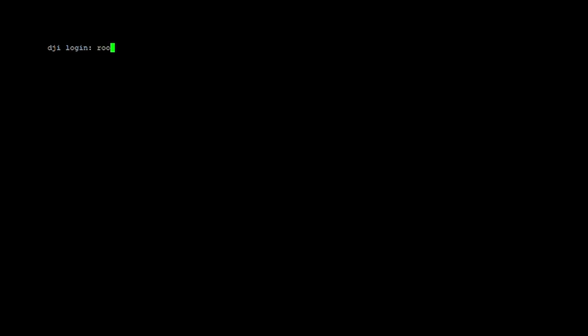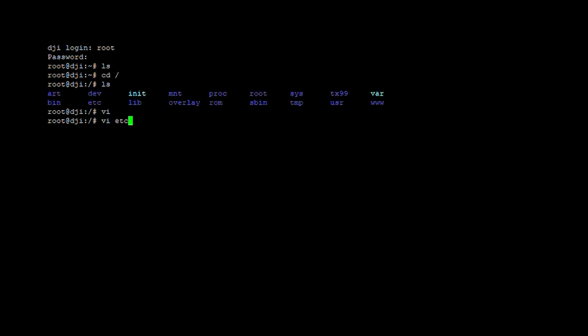So how did I end up with root access? Well, once you have a serial port, sometimes it's as easy as just logging in. Since I already had the password as I explained in my last video, I could just log in as root. Once I was logged in, I could launch telnet and log in remotely as root over WiFi, and I didn't even need the WiFi dongle anymore. Even though getting root access isn't always this easy, finding a serial port is still a great first step in your hardware hacking journey. Thanks for watching, and I hope you start tearing open all your devices and start looking for serial ports — let me know in the comments if you find any.